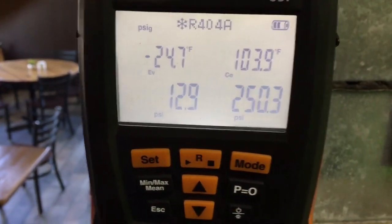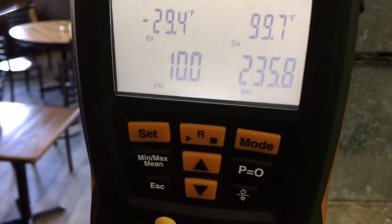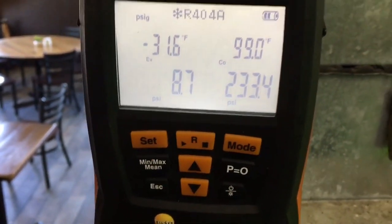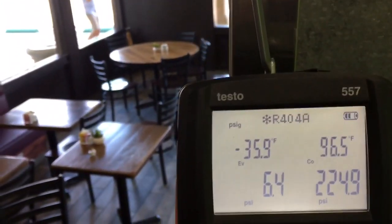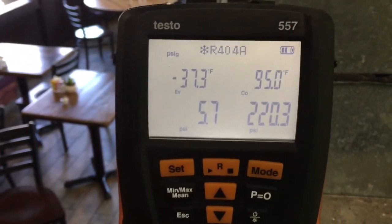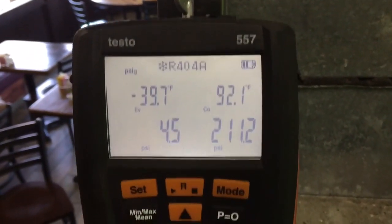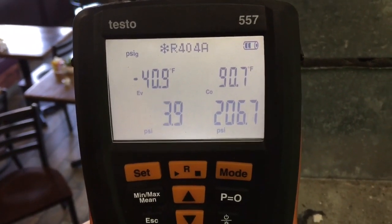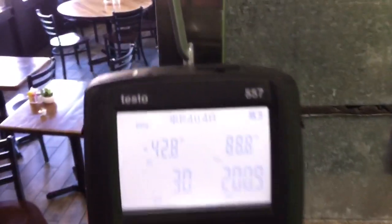Found the compressor. Condenser was totally choked, and the customer was saying it was making a weird noise, going off on internal bypass. This thing's junk — it's got nothing to pull down, it's only pulling down on my hose.